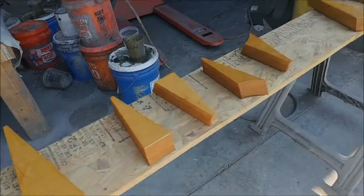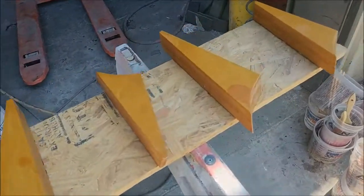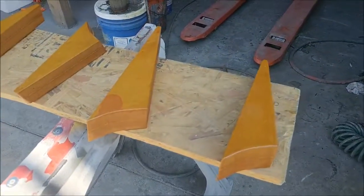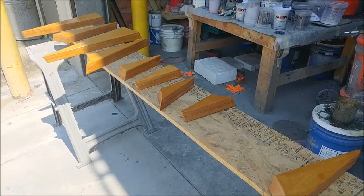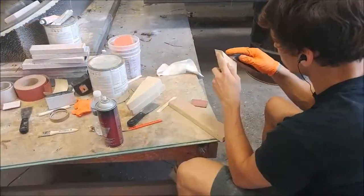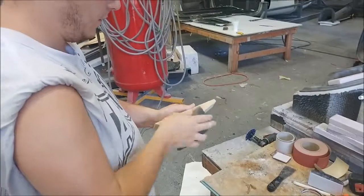The guys are working through them as I'm cutting — giving them a quick sanding, then lacquering them. After they get lacquered, the next step is to give them a coat of primer and another round of sanding.